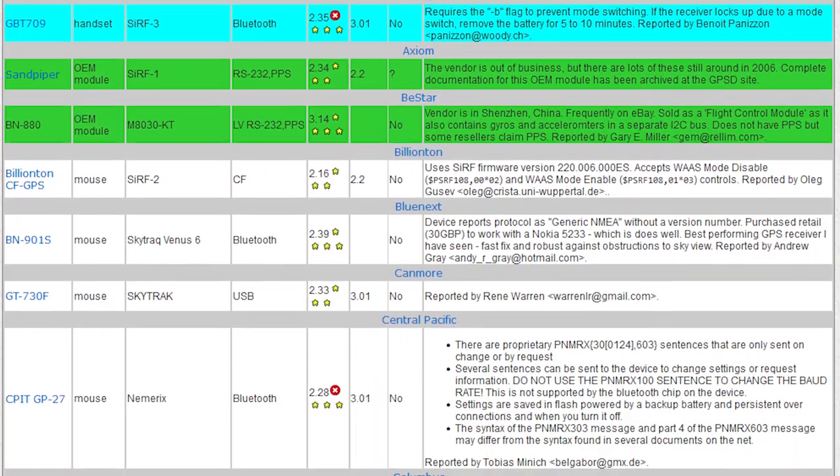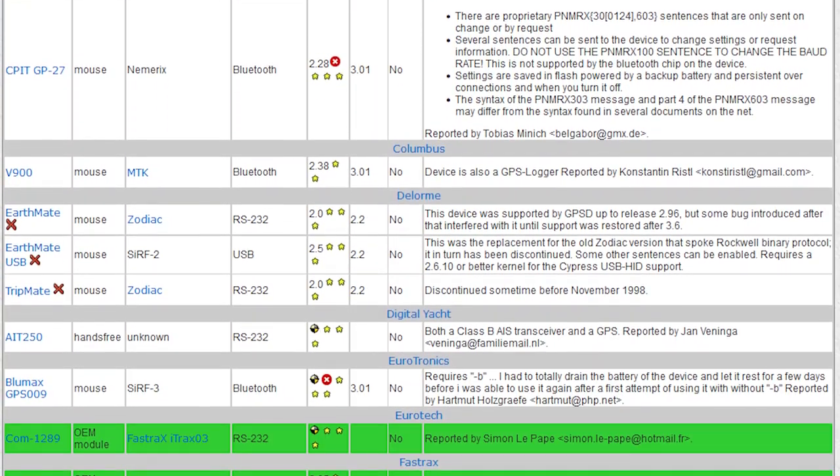Basically anything that supports the U-Blox standard will work. You can look at the GPSD docs and it'll tell you what other dongles are supported. GPSD itself is a great little translator that takes multiple different forms of GPS, even a streaming GPS data stream from your phone. So if you didn't want to use a GPS dongle, you could use your phone over USB to send GPS coordinates to the device and do all your war driving from there. We won't be covering that in this video, but we'll get into it in a future video with a more compact, cleaner case mod.